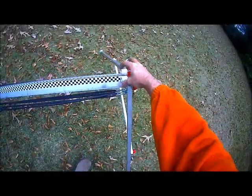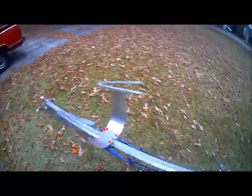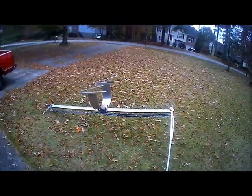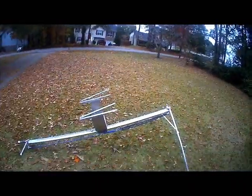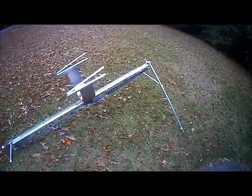It actually hit the end of my legs up at the front — I may have to work on that a little bit. That's the amount of impact force — that's why I have these two rubber bumpers up here. I may end up having to put a pair of safety pins here to help prevent that from getting knocked around, because that's some pretty good force. My X-8 is going to be somewhere around four kilograms; most people's come out between 3.2 and 3.7 kg. Mine's a little heavier because of the bigger batteries. The load force on here ranges from about 3.2 kg up to about 39 to 45 kilograms of force, so that's a considerable bit.